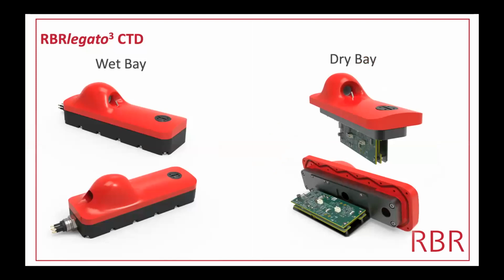And it comes in 2 versions. We have a wet bay version, which is used on vehicles and platforms that have a flooded section where water is expected to be on all sides of the instrument. You can see this is fully waterproof with an underwater connector. And then we have the dry bay version, which is used on a couple of gliders where it's expected to be dry inside and you don't need a bottom covering to protect the electronics.